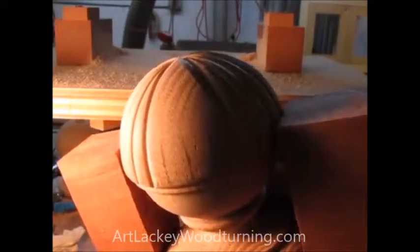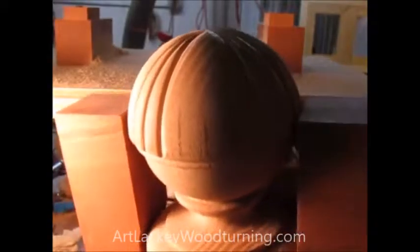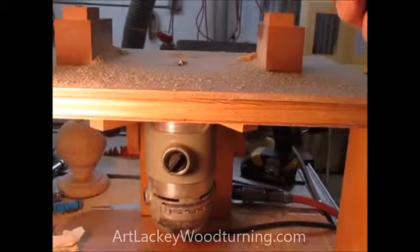Here's one in progress. As you can see, it's not all complete — more has to be done. You can see the lines. What we're going to do is use those lines to center the router bit on. I made this fixture to do this. Watch what happens.